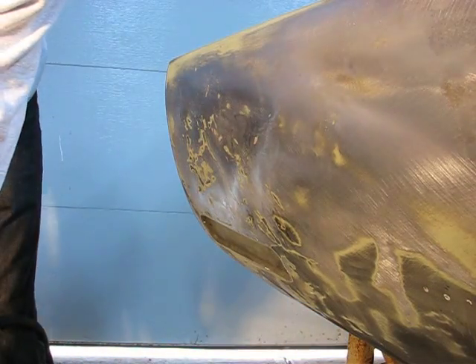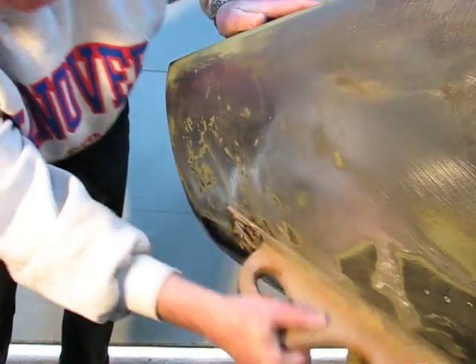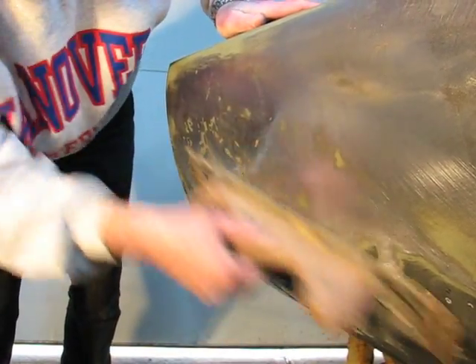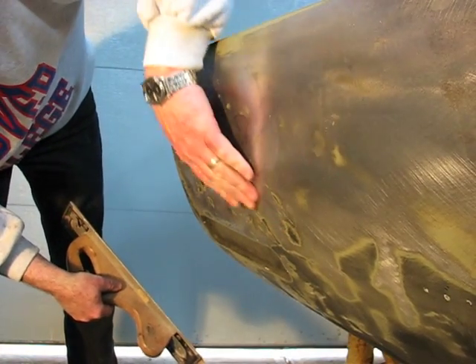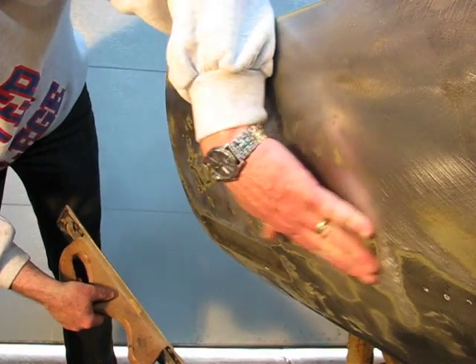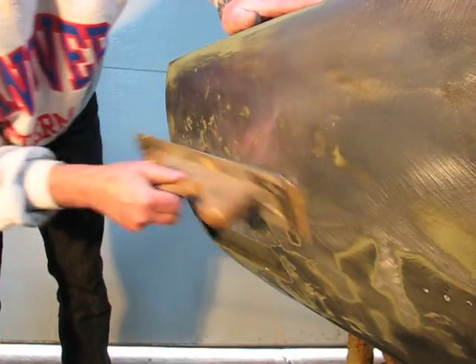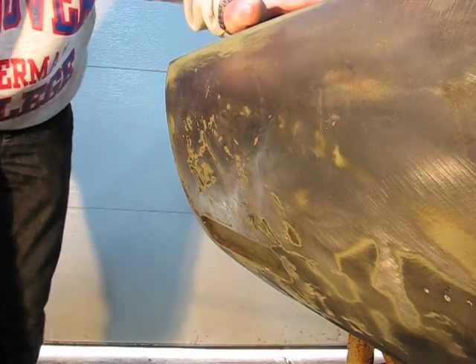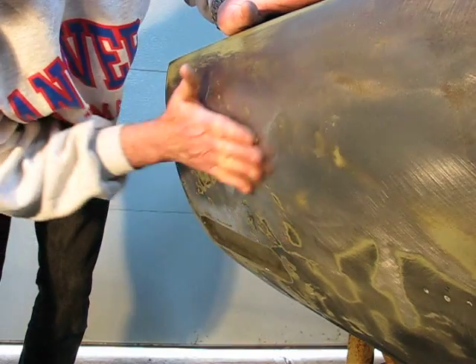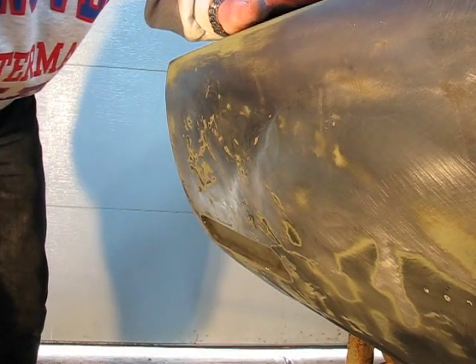The other thing is the air pressure has been reduced. Oh, look at that — see how that spot's getting smaller and this is getting a little high. That's gonna work nice. So anyway, that's how I'm gonna work this panel, and then I'm gonna get this shrinking disc out after I get all this stuff done and I'll take some pictures and show you that afterwards.